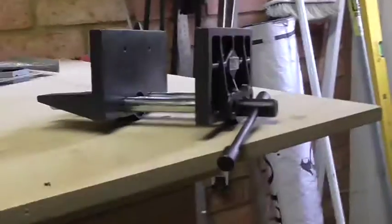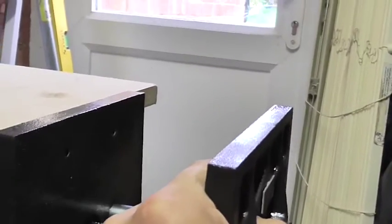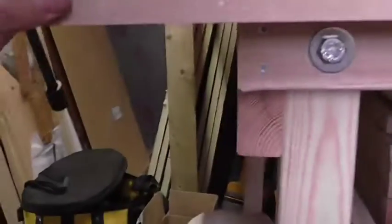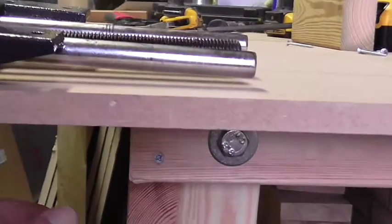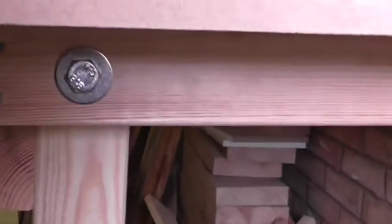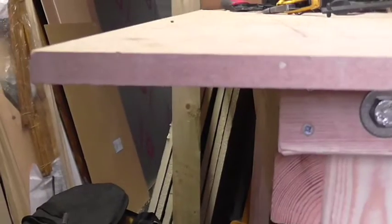I'm going to fit the vice on the right-hand corner of my fold-down workbench. It will need to be flush to the top of the workbench to make it easier to work on things, and I'm going to have to make sure it's solidly mounted on the underside. I've fully closed the vice to see how long it's going to end up. The way I've made the fold-down table, I've got a skirt that's 12.5 centimeters that I've made to put my clamps on. Luckily the depth of it on the corner is far enough over so it's going to completely miss this skirt, which is going to make it a lot easier to clamp onto and screw in.